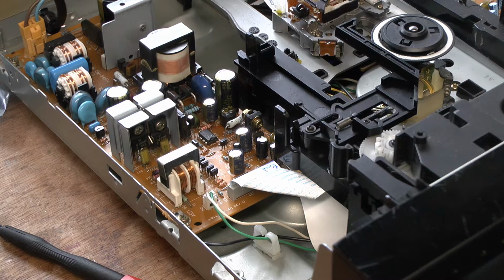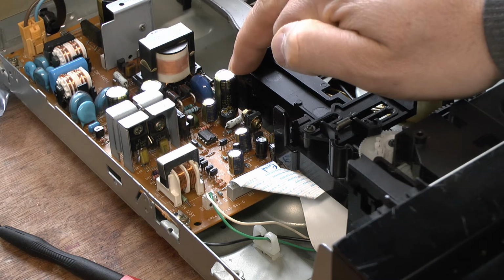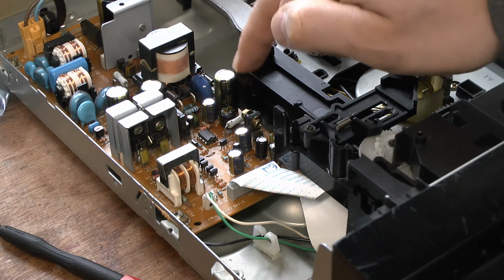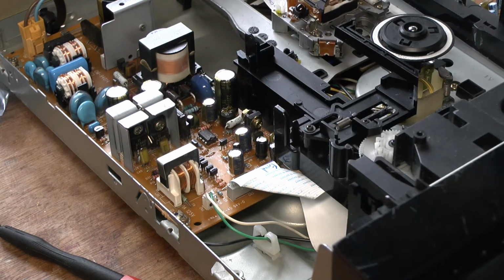Like I said, I didn't want to bore you with my soldering, but again, a quick brief history of what happened. We went ahead and tested the capacitors on this board. One interesting thing is that this capacitor here I tested would always come up as a failure, even when I tested it from underneath. So I took it out anyway, and when I did, it turned out to be the least faulty. It was actually within tolerance, and the rest of them are gone.